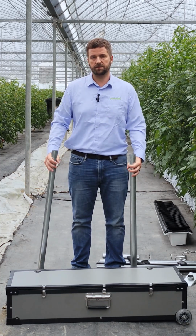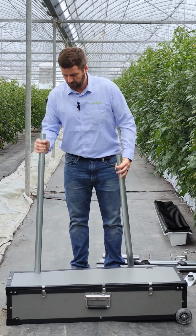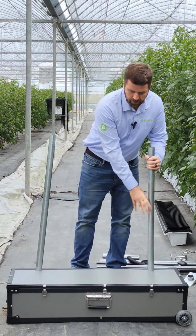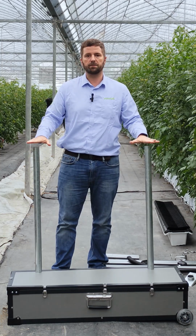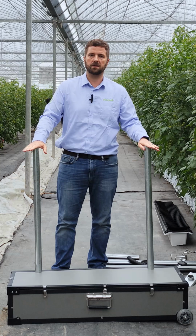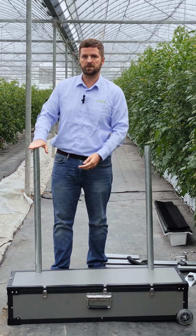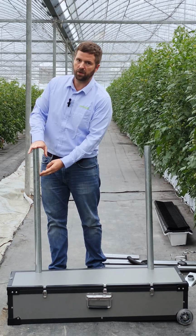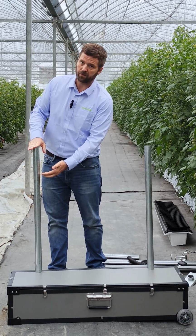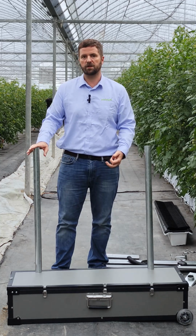Like any system that's based on the ground, the first thing you do is drive the post into the ground. This is where our first benefit is. Most systems depend on the tops of the post being perfectly graded. If you install it the first time, you laser grade it, but then the posts sink, then you have a problem with the drainage. Our system's benefit is that we separate the support structure that has to bear a lot of weight from the gutter that has to have a perfect slope. By doing this, we're saving a lot of money and we're also improving the function of the system.